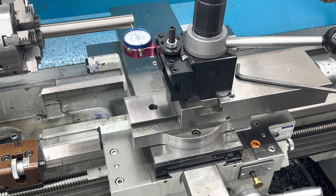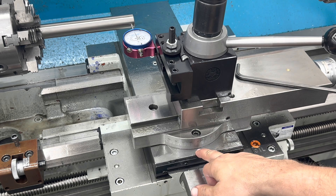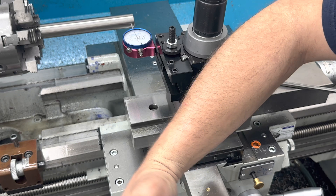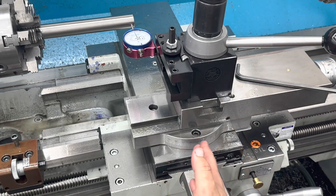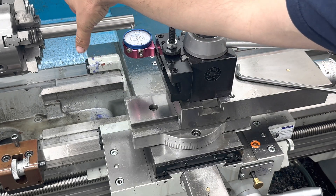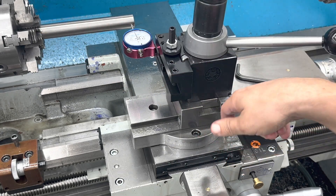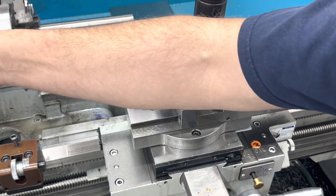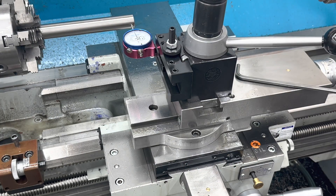We've got the system almost set up. I've got this zeroed out. Depending on what angle you cut — if we're on zero on this side we're going to cut an angle so the larger side of the taper will be on this side. If we put the angle the other way, the larger side of the hole will be on the inside of the lathe, and we don't want that. We want it on the outside so we can test fit the barrel to see how much bigger we need to go.